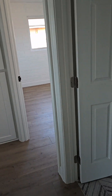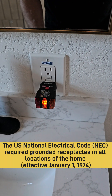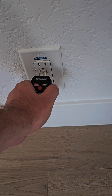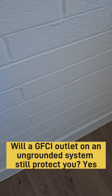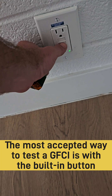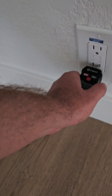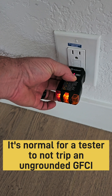The funny thing is, they said they would fix it, so they replaced all of them in the house. We've got a GFI down here — still no ground. GFI down here — still no ground. It works with the test button, but if you're testing the grounding, this is supposed to trip that outlet and it's not working.